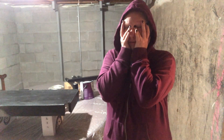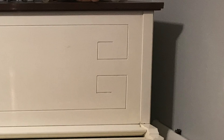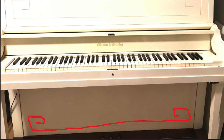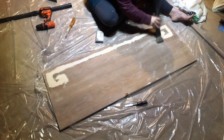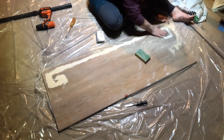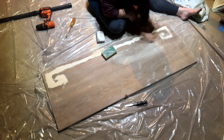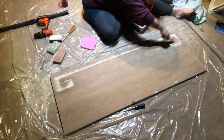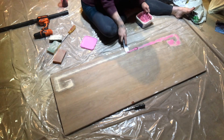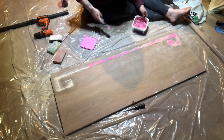While I try to figure out how to fix this mess, let's move on to other things. Thank God I did a test piece. I hate this engraved scroll work — there are two on the face panel and one on the foot panel. I'm attempting to fill the engraving with layered wood putty on the foot panel first because it's less visible. Each time I fill it, I have to let it dry overnight. This is my third layer I'm sanding off. I'm using a colored wood filler that starts out pink and turns brown as it dries — I really love it because I never have to guess if it's ready to sand.